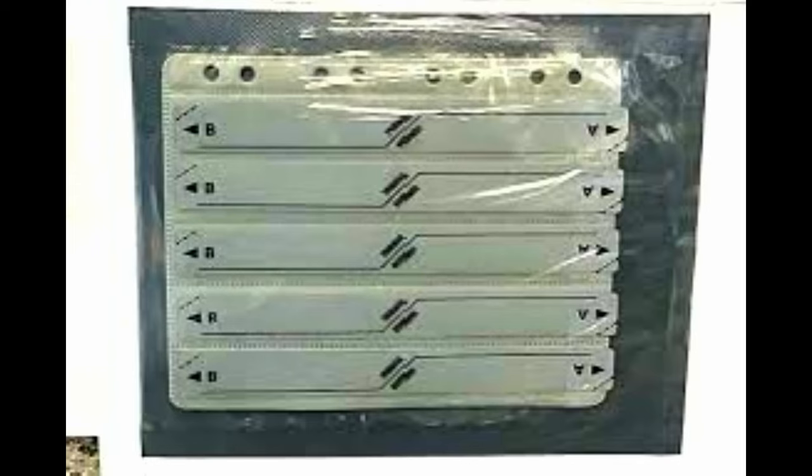What's also awesome is that unlike most 80s synthesizers with digital patch memory, which required a small battery soldered onto the motherboard — those batteries love to leak and can eat a motherboard alive — the CS70M has a section underneath the headphone jack where you can put three AA batteries in. That's what it uses to store its patch memory, so there's no risk of leaking onto the motherboard. They also created a magnetic card interface where you stick a card into the synth and pull a preset off it, with a wallet of magnetic cards including blank ones for your own presets.